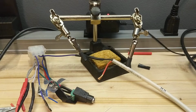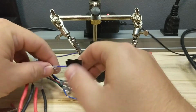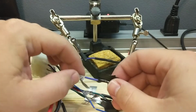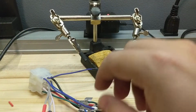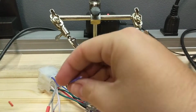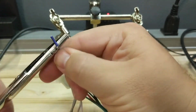And then you mark the other side of this cable at the same time. We're gonna skip that, for reasons. So now we'll go ahead and do the soldering. The iron went to sleep there. Don't go to sleep, it's not that time. So we need the other purple wire. This is the positive side, so right rear speaker positive. You see how I pull this little flag off, because we don't need that. And I'm going to cut off the tinned end because I don't like it. Like I said, I kind of suck at soldering, so I just do my own thing, and it works out okay.